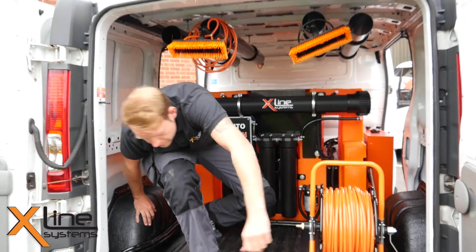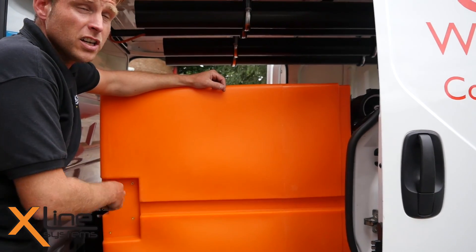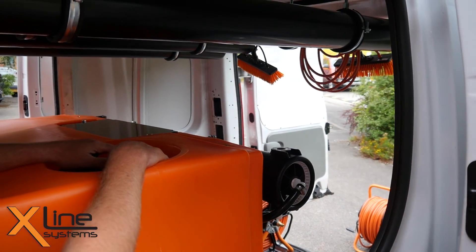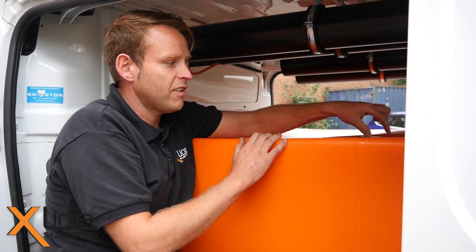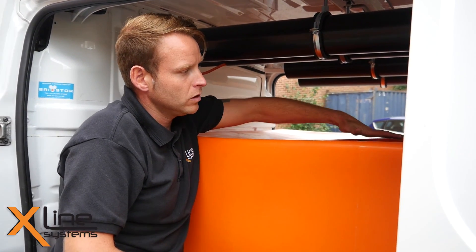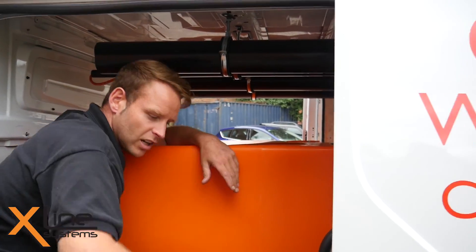Going around to the side, you'll see two more controller mounting positions — the same on the opposite side as well, which I'll show you in a minute. That's where this customer has chosen to mount his controllers. Another key feature is the actual lid itself. On a lot of other tanks, the lid sits proud or flat with the top of the tank. In window cleaning you need a vent in the lid so air can enter when you're drawing water. What we've done is lowered and sunk the lid so it acts as an anti-splashback lid — if you get any water sloshing around, it stays in there rather than running down the side of the tank.